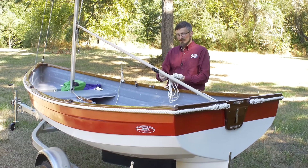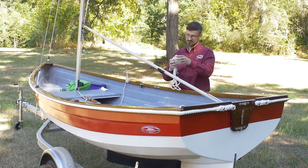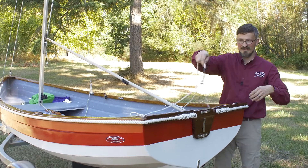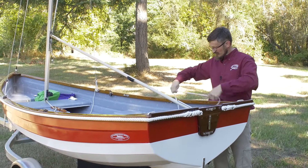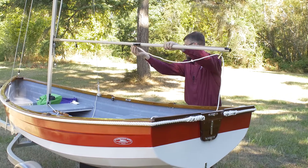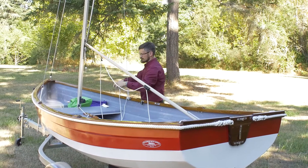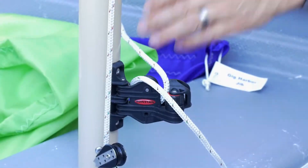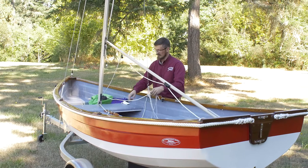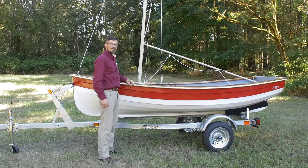Once we've got the boom fastened in place, we'll need the main sheet to control the sail once we have the sails up. The main sheet I usually keep clipped to the boom somewhere — just to make sure it doesn't get lost. We'll uncoil it. It has a clip at one end; the clip gets attached to the traveler at the back of the boat and it just slides back and forth. Find the other end of the main sheet and run it up through the block in the end of the boom, down the full length of the boom, through the second block at the front of the boom, and then down through this big complicated piece of hardware at the base of the mast and out through the jaws. Take out the slack and just for good measure tie a knot in the end. At this point the standing rigging is all put together — the only thing left to do is to put up the sails.